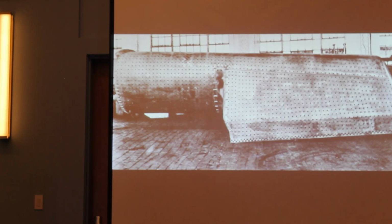Another advantage is, again, no joints that can leak when you're done, no hot spots, and it's easier to fit up the plates to each other. Versus what we had before with that lap joint. You have to flange it, of course, but you don't have to worry about the lap and fitting all that. You can't have a gap in the joint. You have to have it nice and tight, and it takes time. You have to heat it up, pound it some more, get it fit nice. And you have to get your holes. The holes are already in the plate, but then you have to run a reamer through before you put the rivets in. That all goes away.